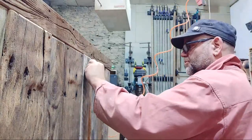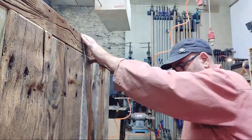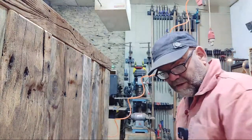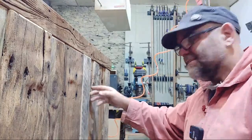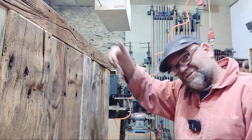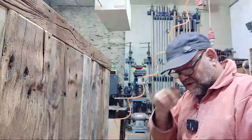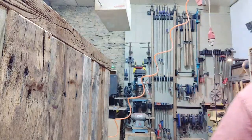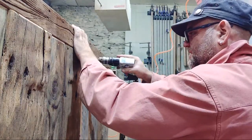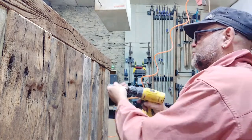Ooh, I'll put a screw in there, but there isn't actually anywhere. I'm going to have to redo that one, because it's missed. I think that's the edge of the cabinet. Actually, I didn't put a screw in there at all. Take that out. I'll just plug that. I've missed the cabinet at this point. There's an end carcass on this end, and there's an end carcass on that end. There's a void in the middle where your legs go. But where I put a screw in here, it's literally in the void in the middle, so it's not screwing into anything. So I'll leave it out, and I'll just plug that. That's what happens when you wing it. So that needs the screws up top instead. Two in that one, because I'm feeling generous.